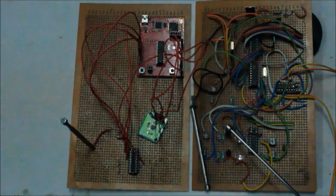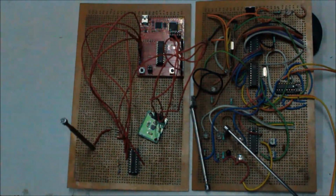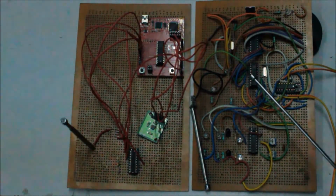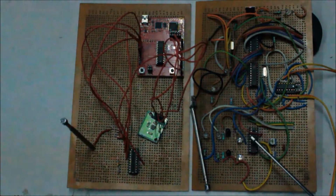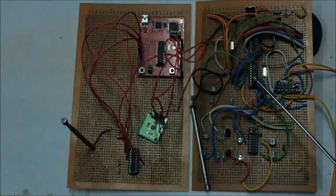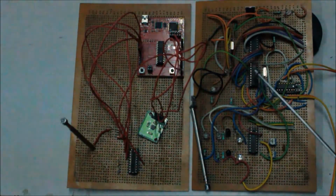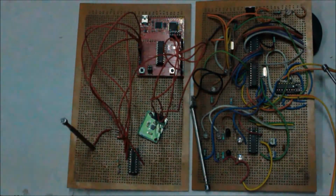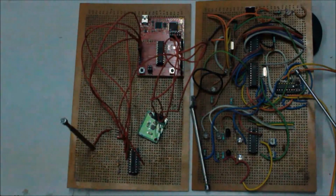With this IC, we have attached an IR transmitter and IR receiver. Whenever the receiver detects an object, it transmits the control signal to the LM324 IC, which in turn passes this information to the microcontroller. Based on the outputs received from LM324 and HT12D, the microcontroller generates the control signal and passes it to the L293D IC, which in turn drives the motor in the desired direction, and hence our gesture implementation is achieved.